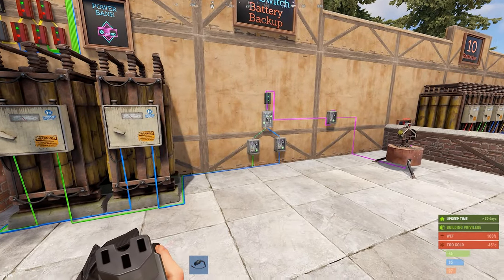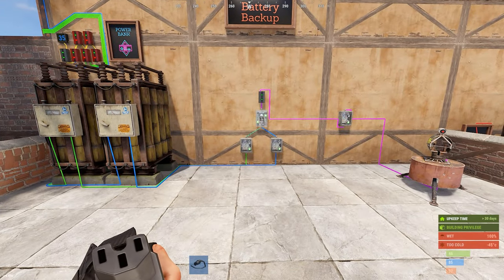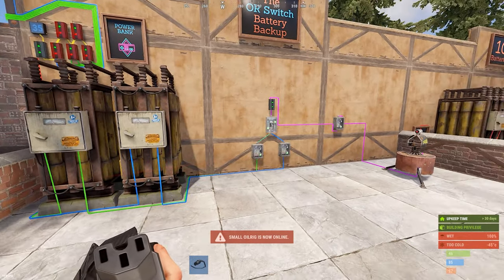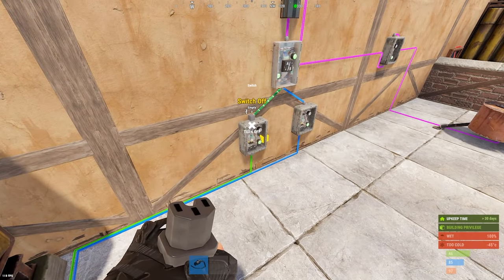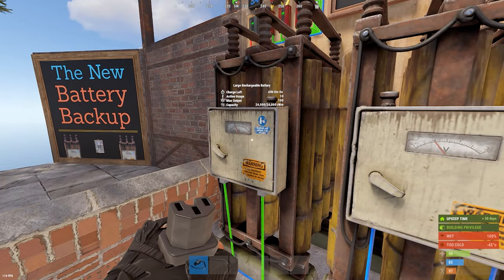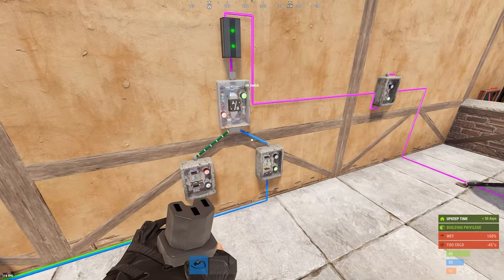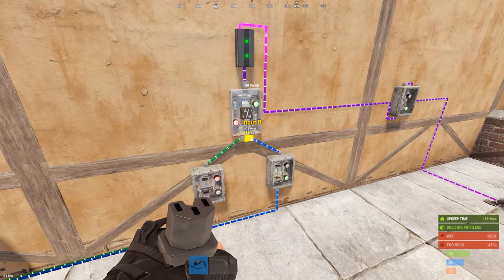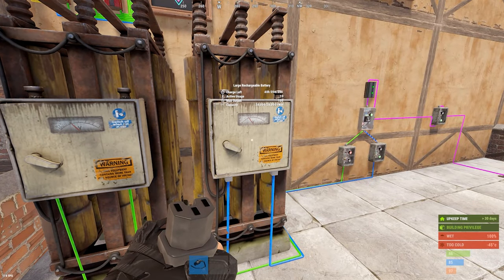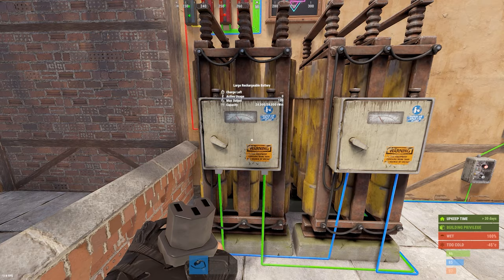This is huge and this is why this works. That's really all you have to do to set this up — minus charging, which we'll cover in a second. But let's say I cut off power to the primary battery — the green one, which currently has the active usage. If I cut power to that, you'll notice I've now switched over to just the B side coming in, and the blue battery has an active usage of 10 whereas the primary shows zero.